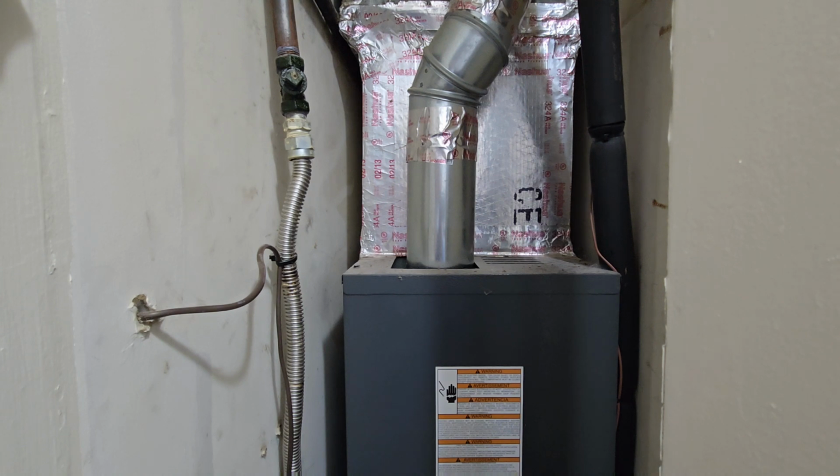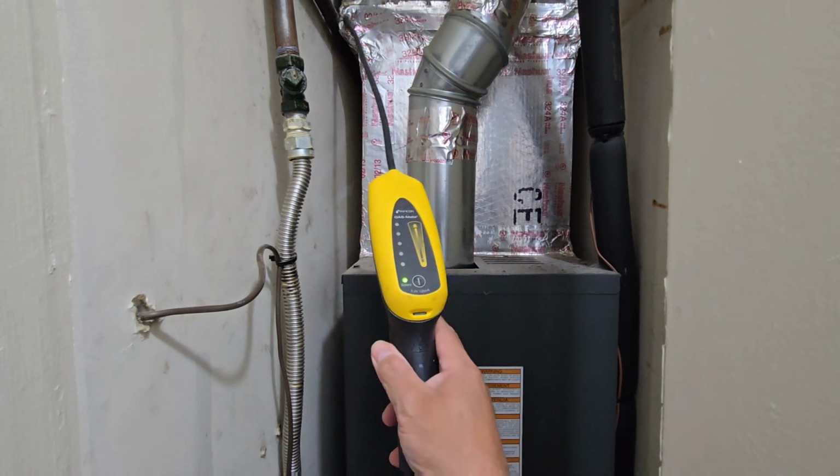Now we're at the bottom of the shutoff. We're moving up nice and slowly. You don't rush this. I'm going to air it out again and keep going again. That's just to me is the gas line. So we're going to clear out my meter. And we're going to start from the top, the black iron pipe.